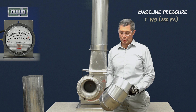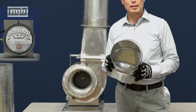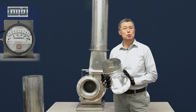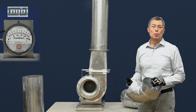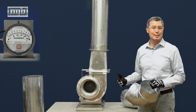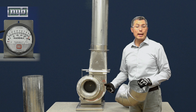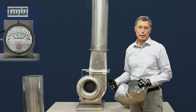Live demonstration time. We have two 90 degree elbows — just straight 90 degree elbows, nothing inside of them, no turning vanes, no obstructions. And we're going to connect them in a corkscrew effect that's going to either pre-spin or counter-spin the air as it enters the fan. When we talk about that, we're talking about whether it's rotating air in the same direction as the wheel rotation or against the wheel rotation.